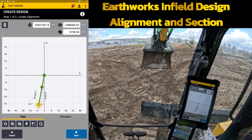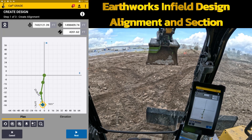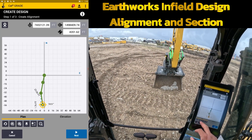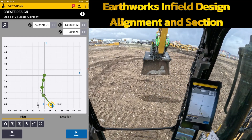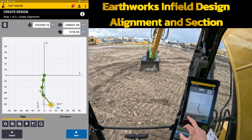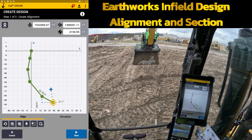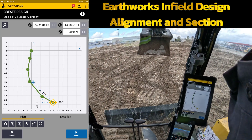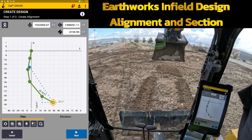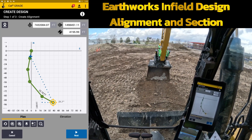I'm going to hit a couple more here. To demonstrate, it doesn't matter what the elevation is — I'm going to record this one up in the air a little bit higher. I'll take one more right there, then spin around and start bending back behind me. I'll do one that's down a little bit lower again, and then create another one to finish out our alignment — right here is where I want my ditch to stop. Now that I've got an alignment built, we'll spin back around and get set back up where I started. It doesn't matter if you actually get lined back up with it.